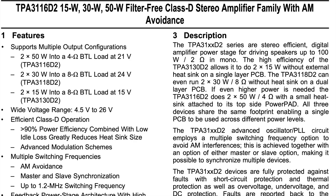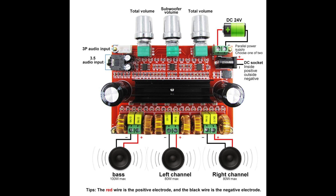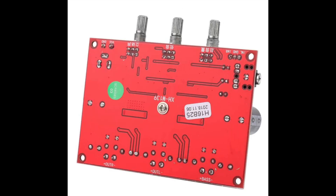The new amplifier consists of two TPA3116 class-D amplifiers. Each one is for two outputs of 50 watts, but one of the two is in bridge mode, giving 100 watts - though realistically they'll pull around 80 watts. The configuration has one amplifier in stereo and the other in mono, with operational amplifiers (741s) configured as filters for the subwoofer output. The schematic says 80 watts but I don't think it'll even pull 40 watts, though it will give a lot more power than the original because it's class-D.